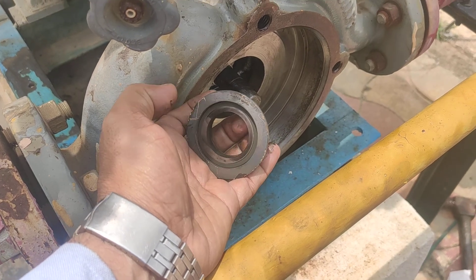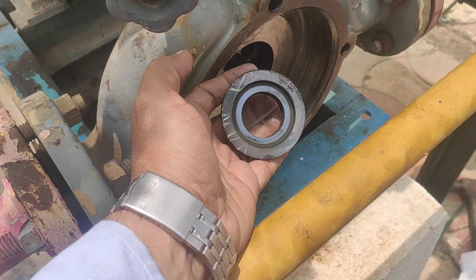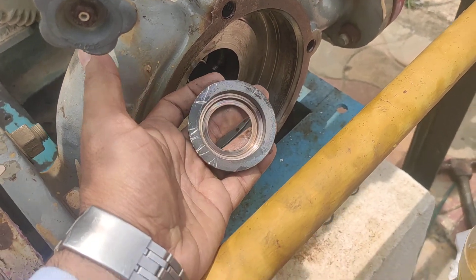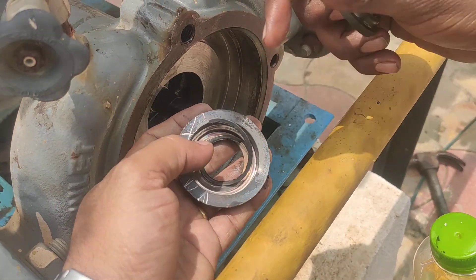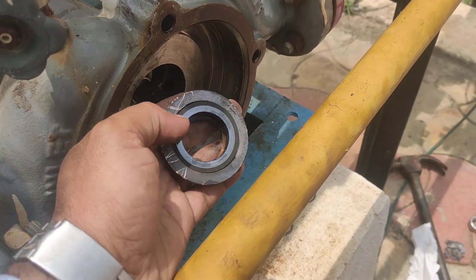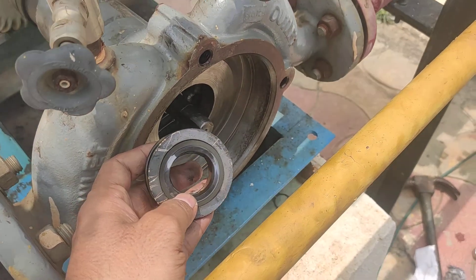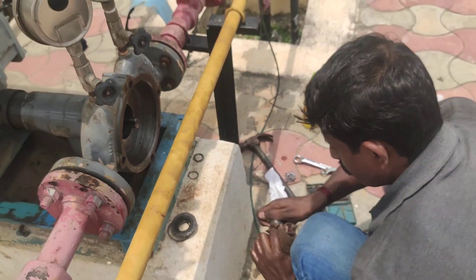After the back-side O-ring goes in, the housing sits on the shaft, and then there is one more O-ring. This additional O-ring is actually damaged. The stationary seal then goes in like this — together with the housing it has to go inside the pump onto the shaft. That activity has already been completed by our engineer.